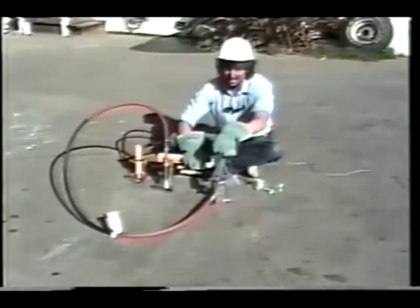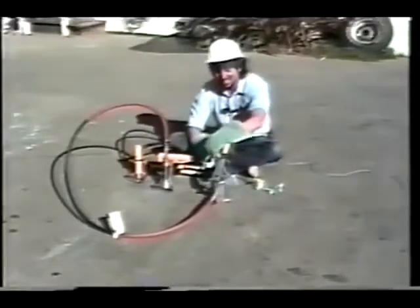Okay, with this in mind, let's go up to our test doors and take a look at how these tools work. This is an example of a solid core door. Fire door. Heavy. Hard. Difficult. We've installed a long throw deadbolt in this hole. Keep this door in place. The door is solid. I'm going to take the Rabbit Tool and see what it does. The jamb has enough room that I can slide the tool in without hammering, so we're in.